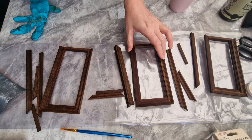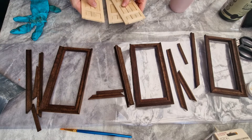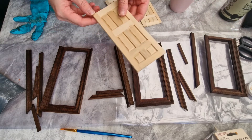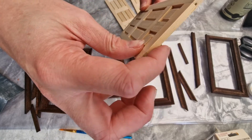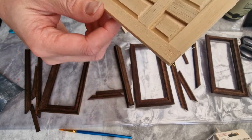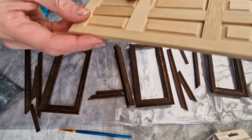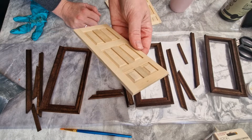I do want to varnish these as well, so I'm going to wait until they've dried completely, see how I like the colour, and then look to get them varnished. In the meantime, I need to be painting the doors. I have the doors here — I'm going to remove the remaining pin. I'll have a very light sand to remove any stray bits and smooth around the edges. The rest of it I'm not going to sand — I'll just paint it and see how the grain comes up and decide then whether it needs sanding.